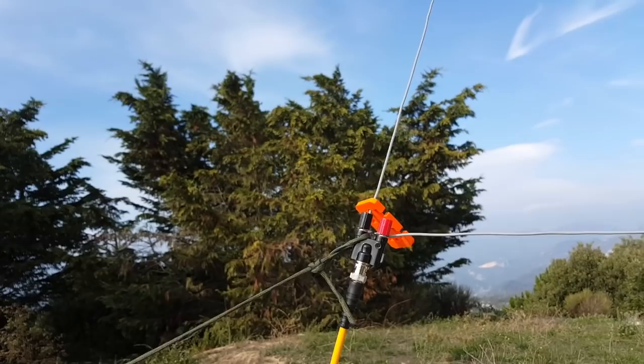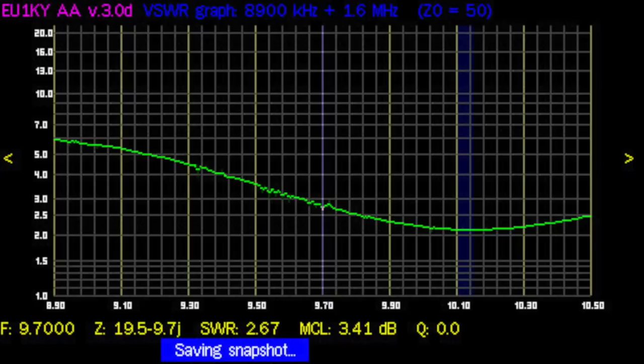So the SWR with the 5 meter 75 ohm cable, I have to stop repeating that, is 2.1-to-1. And it's perfectly usable, but, you know, it could be a bit better. And I'm hoping the balun will do better than that. If we do the math, of course, it should be perfectly spot on. So I think the balun is probably going to do a bit better.